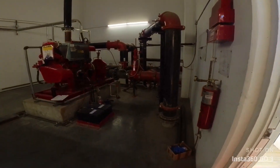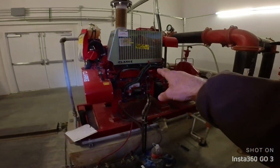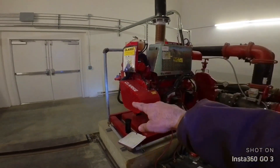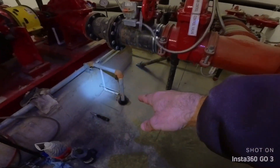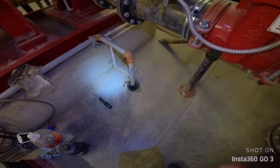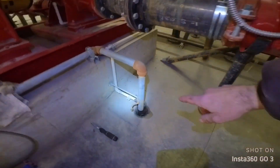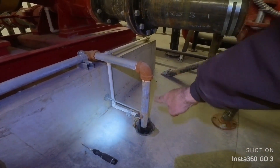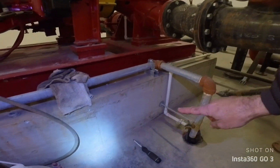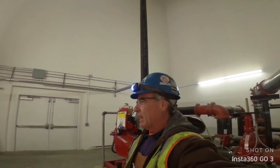Here's what I'm going to do to figure out how much water is coming out. When I start this fire pump — it's like a big loud engine — water comes circulating through the inch and a quarter line and goes into that drain right there. That drain goes into a septic tank, and we're filling up the septic tank with too much water. I got to take this piece of pipe out and put on my inch and a half hose.